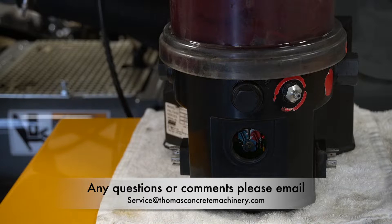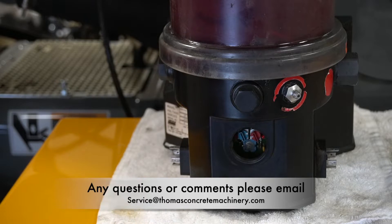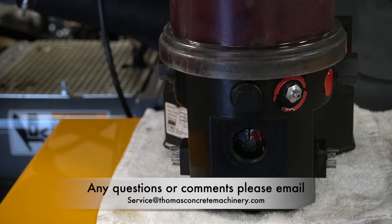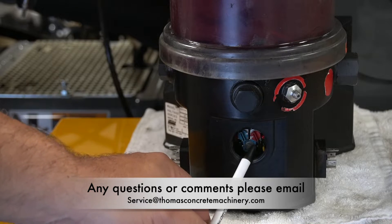This unit has two knobs: red and blue. The red one indicates how long it's going to run the pump for. The blue indicates the time intervals — for example, one hour means it's going to come on every hour on the hour. Two hours means it comes on every two hours, with the red knob controlling the duration.